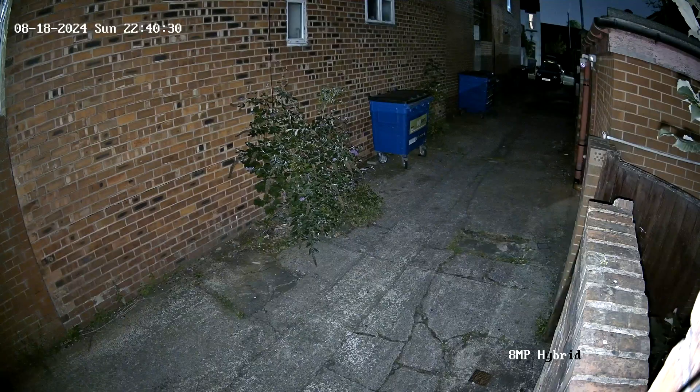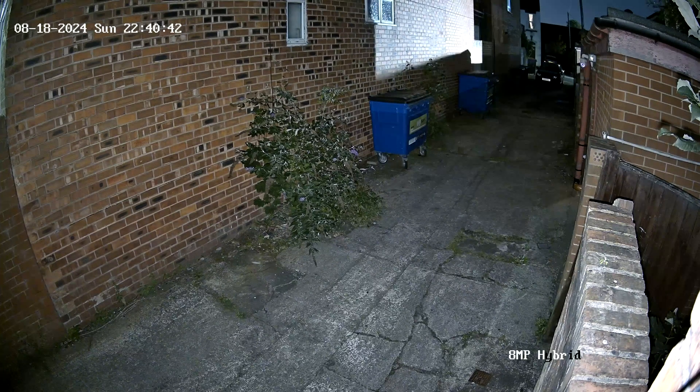But you've got to remember, 45 metres is a hell of a long way for a CCTV camera to see. The main issue with our test rig at the front of our shop is that there's a lot of ambient lighting around us — street lighting, cars, and other businesses all add to the light that spills over onto our camera and gives it a boost. So to really see how this camera performs, I moved it over to the back of our shop where there is nearly zero ambient lighting, and you can see that the camera performs really well. The inbuilt LED has come on to give the camera a boost of light and means it can see quite far down that alleyway.